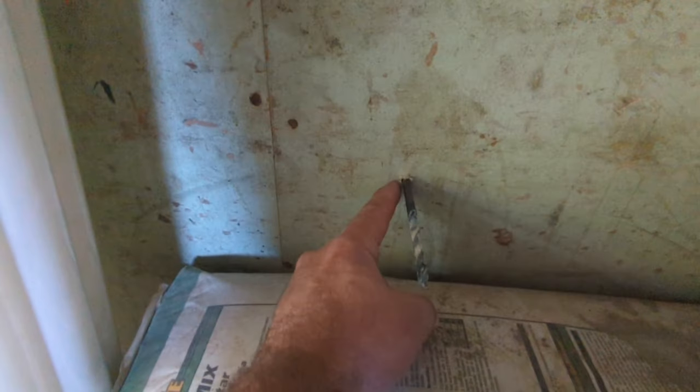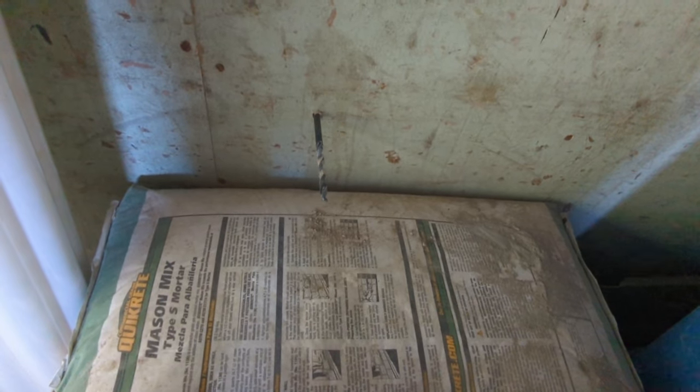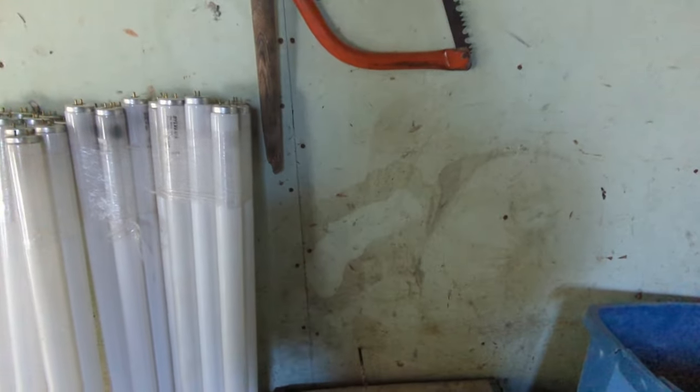I'm right next to the seam in the sheet. I'm right across the top of the sole plate. It's right about where I need to drill right there, so I can sort of just move, you know, 3/4 inch down, strike a horizontal line about up here, about over to there. I guess there's some benefit to going up plenty high enough, so I've got the elbow coming to me, the whole down tube and the elbow going down into the basement happening right all in front of me, instead of making two pieces, wishing I had made more of an opening.